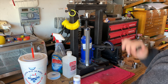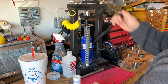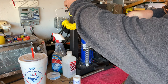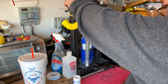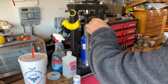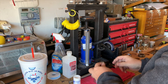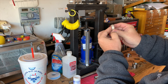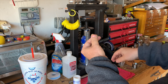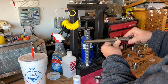From experience I can tell there's not a lot of room here, so I'm going to go until the die hits the top of my press — otherwise I would inch up on this thing. This ring is really starting to look very, very good now, and again, I'm checking the size. Always checking the size of the ring.